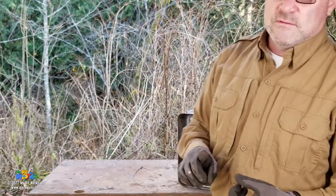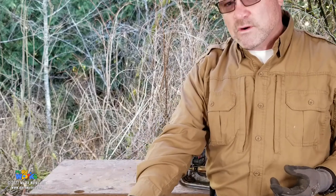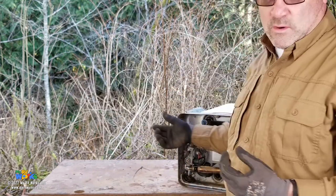So we followed our trail for water. We've now followed our trail for DC. It comes in from the switch. It comes through our red wire to our DSI board on the red wire. Yellow wire is ground. Blue wire goes back up to the switch to turn the light on, leaving with the brown wire and our electrode wire. Okay.